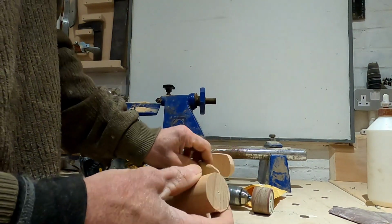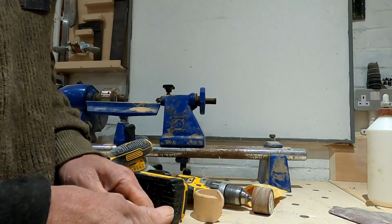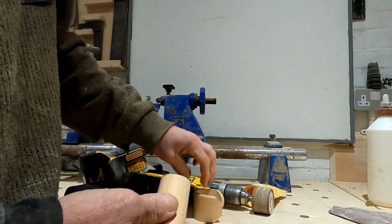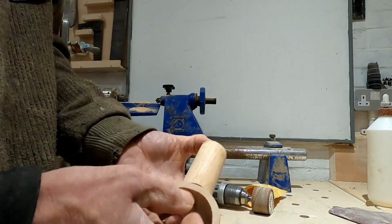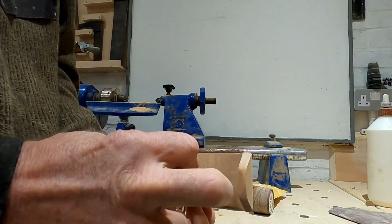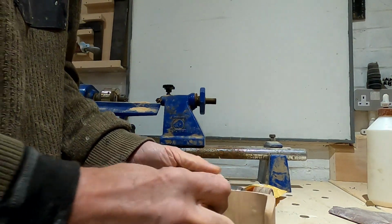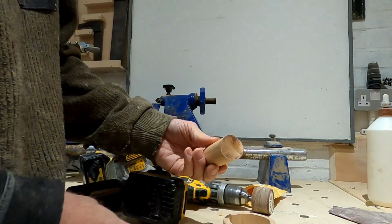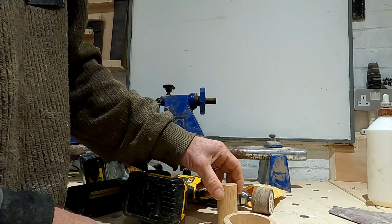So just going to drill a hole up the end of the arm. I just made these 35mm, same as all the other dowels. So I'll drill a hole up the end of his arm, poke these up, and I'm going to glue and put a little tiny dowel through the end of his hand up into there, just a small one so you can't really see it, because the ends of his hands are open so you can see it. I don't want to drill a big hole and put that through because it won't look right.